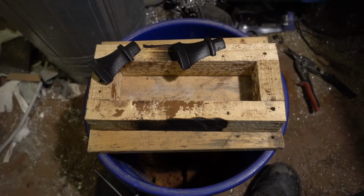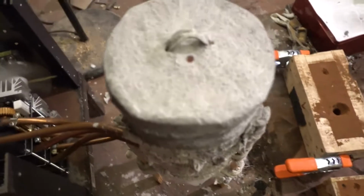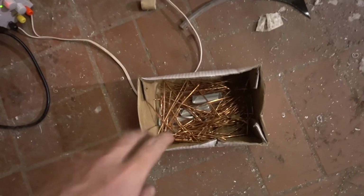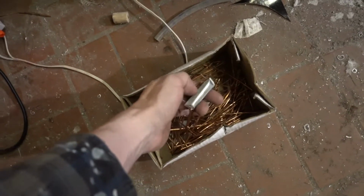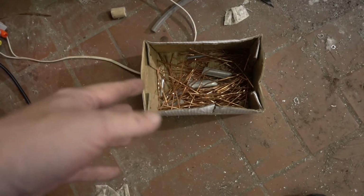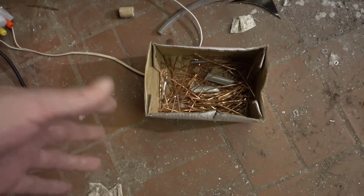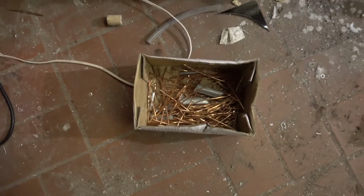Okay, so we'll now start that. Okay, that's stuff partially in. As you can see, it's melting or starting to. This is just some recycled cables, and the same is true for the aluminium. If you want to get pure aluminium or pure copper, cables are a good option, because any impurity will decrease the conductivity of the material. So in cables you typically have pure stuff. So I will now put all that in.